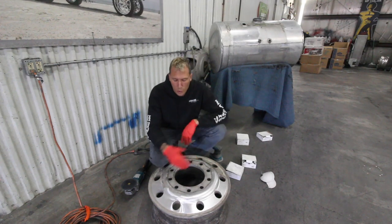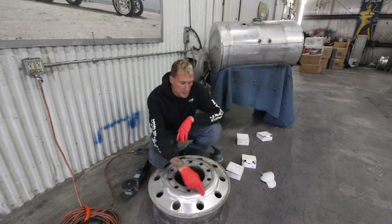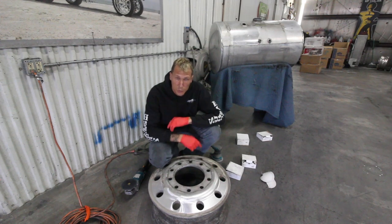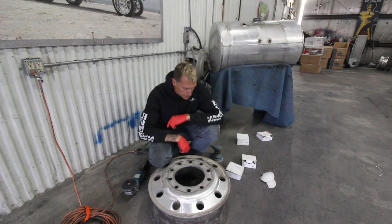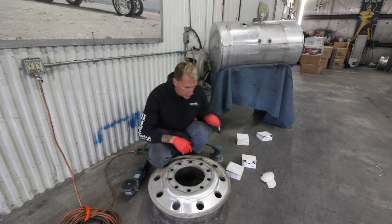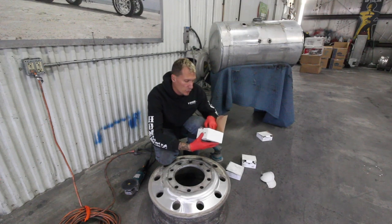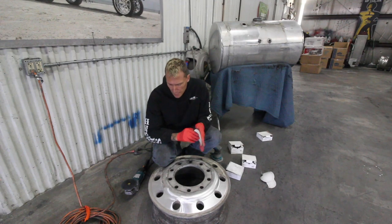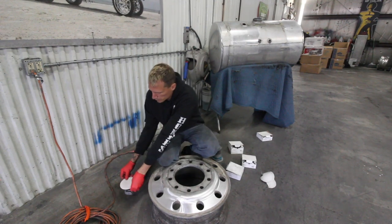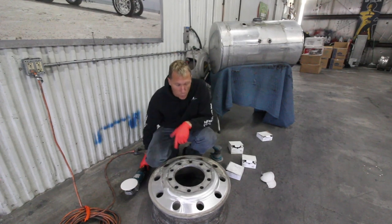Now, if you cut down with the rotary, if I were to cut this down with like a 180, I'll knock out a lot of these pits and a lot of these heavy gouges really super fast. So what I'm going to do here is try and bring you in real close and show you how you can take that out rather quickly. I'll even show you how you can knock down some of this. If I throw an 80 grit on a rotary, you're going to be doing some heavy, heavy damage. You'll take this out really super fast. So I'm going to zoom you in right here so you can see it really close, and hopefully you can catch it.